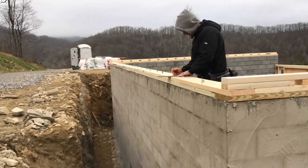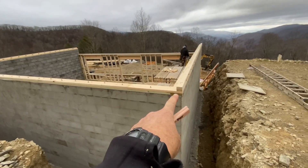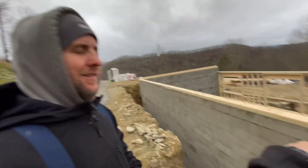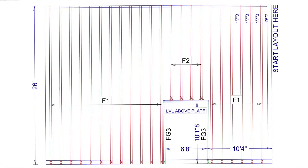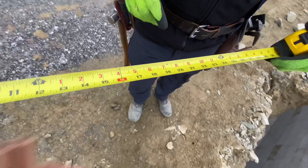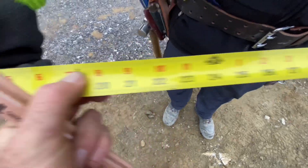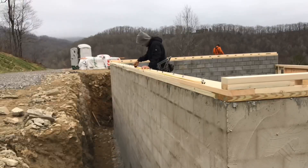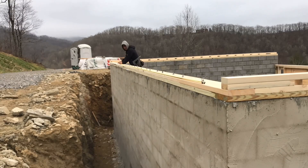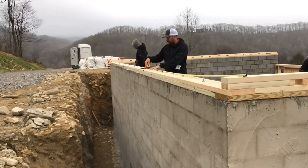Our first task — let's get to work. We're going to lay out these walls for the trusses. The layout starts here at 19.2-inch centers, because that's what the truss plan says. The diamonds on the tape measure are pre-set for 19.2s, so you don't have to figure it out. 19.2-inch centers is one less truss per eight feet than 16-inch centers, and one more truss per eight feet than 24-inch centers.